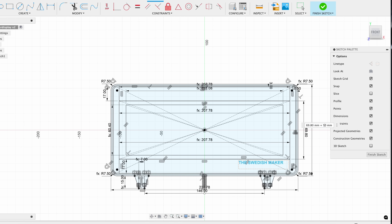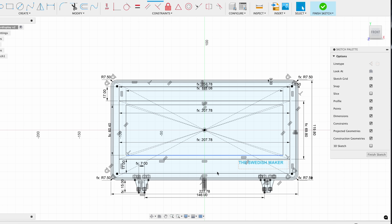So I have a backup plan — I will increase the size of the box just a bit, and because of that I think I'll be able to fit the wires I have right now. The parts I'm waiting for are these angled connectors that will allow me to attach the USB-C at an angle without the power cord sticking straight up. On the upside, I get to show another cool feature of drawing in CAD: I can go in and change the dimensions of the entire box without ruining anything, and everything adapts because of parametric modeling.